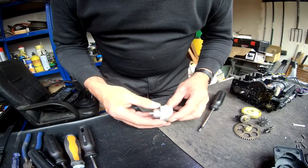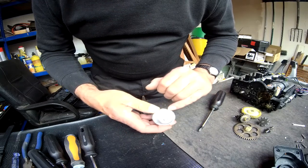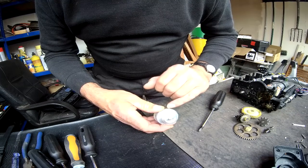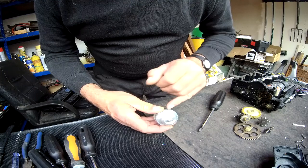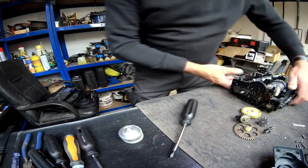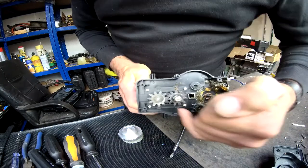The only problem with that is I end up with square teeth. If you look at the end profile, the gapping is slightly different on a couple of them, but that's not a problem because they've got to be dressed down to shape yet. But the profile of the teeth is square. What they actually need to be is shaped like that.